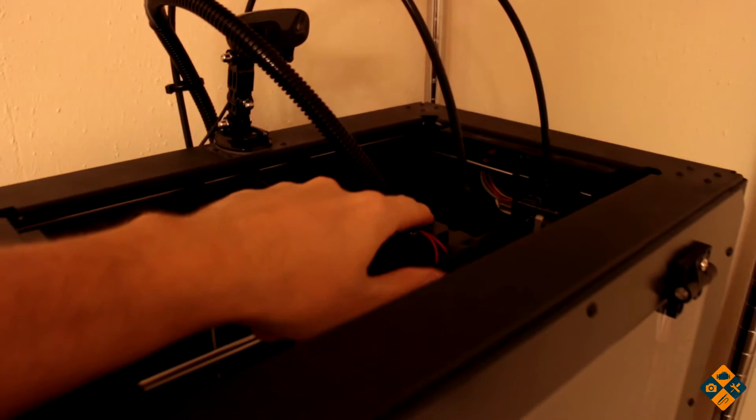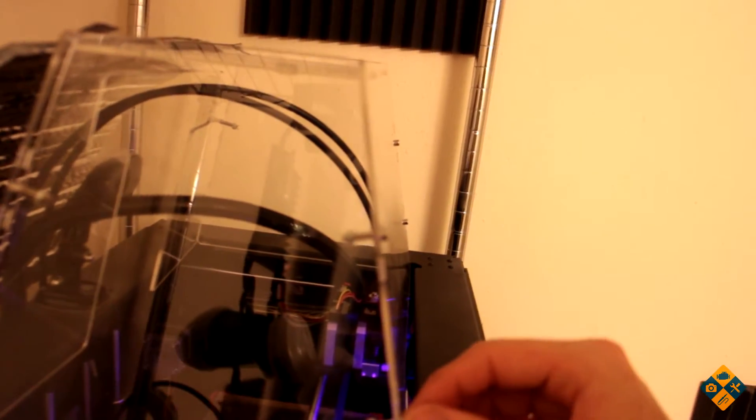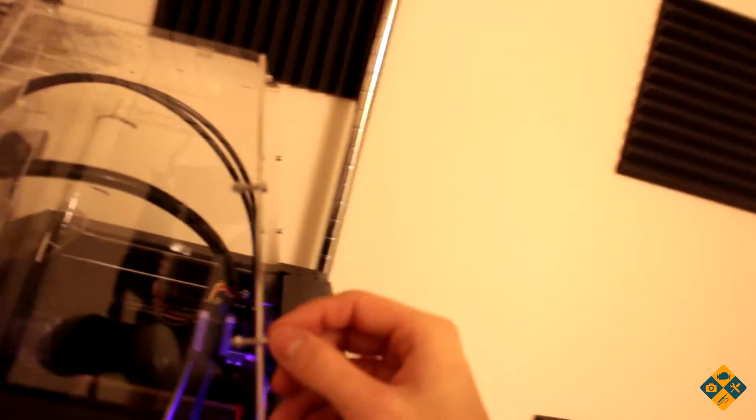It's always a struggle — one of the nozzles keeps jamming up. I think it's because I'm using this right nozzle and it doesn't like it very much. After some much needed troubleshooting, the 3D printer is back in action. What I had to do was clear out the left-hand side and lower the head, raising the head on the inactive right side. The nozzle is clogged — I tried the filament cleaner and it was no dice, it just kept clogging. There was some sort of obstruction so eventually I'll clean it out.